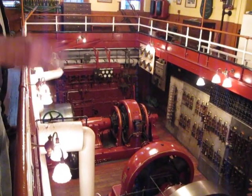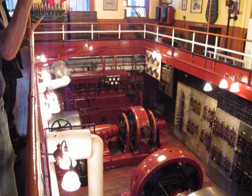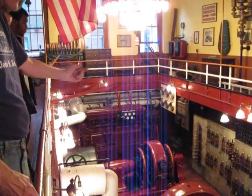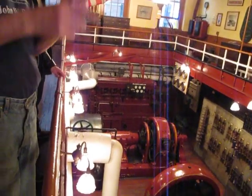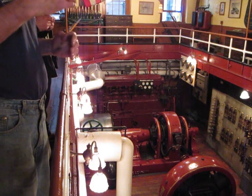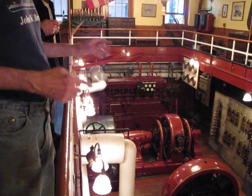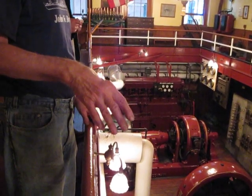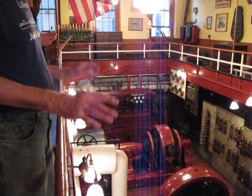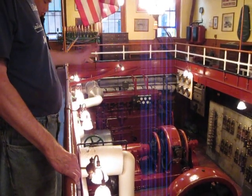There is a big steel rotor inside that casing with thousands of tiny blades on it. The blades may be about as big as a finger and they're all at a slight angle. Steam is allowed to blow into the end of the turbine, and as it hits all these little vanes it causes the shaft to rotate. It goes through the turbine hitting one row of blading after another until it eventually comes out. The motion on the turbine is directly rotary, whereas this engine has to convert from reciprocating to rotary. Turbines are much more efficient than steam engines, especially in large sizes, so any big utility plant today will have a turbine.